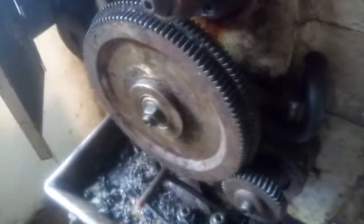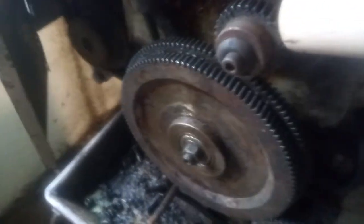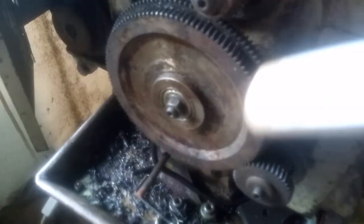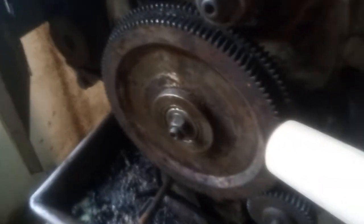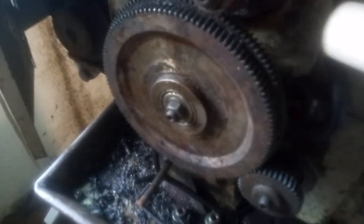And we'll just stop there now. So here we have 32, which is divided by 8. 8 will go into it 4 times. You have it driving an intermediary wheel, which is 120 and 127 teeth. And that drives a wheel with 40 teeth. So this one and this one are divisible by 8. And this one here, divided by 8, will give you 15. And this one here, divided by 25.4, gives you 5.